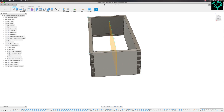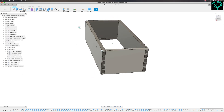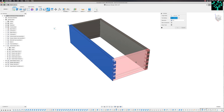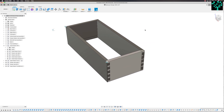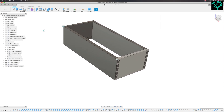I'm just going to turn off this midpoint plane — never delete the midpoint plane; if you do that, your parametric model won't work. So go into Construction and turn off the last plane. Now to put the joinery into this front panel and this back panel — we've done this before with the combine tool, our router tool. Select that. What do I want to cut? The front panel. What do I want to cut it with? With my tool bodies — this panel and this panel. I want to cut but keep those tools. My joinery is now in place. Right-click, repeat combine — this panel, this panel, and this panel. So I've now got all my joinery in place.